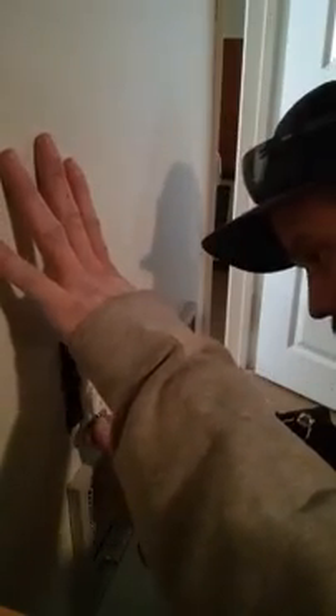Still acting like it's hot. Flipping it over — this is grounded now. Push the wires in, bend them, fold them. Make sure they don't touch each other when they go in, because if you have an arc-fault breaker and the ground is touching it, it won't stay. Usually pushing in with one hand — just so I don't get close to that hot.